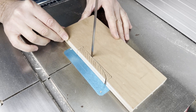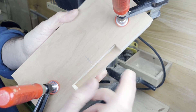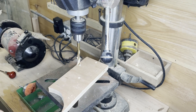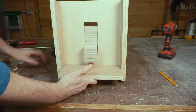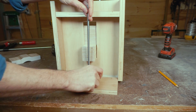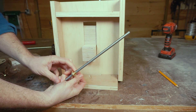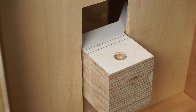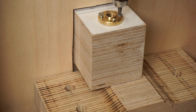This is one of two ledge pieces that are holding the lead screw in place, and this one needs a little notch cut out because there's a dust guard that passes through it. Then I'll clamp that to the other ledge piece so I can align the holes being drilled in them and drill them both in a single pass on the drill press. Here's the carriage — this is the bearing block that's going to be attached directly to the carriage. Those two ledges are going to have bearings on them, and this lead screw nut is going to be right on there. I'll mark that off, drill a clearance hole that the lead screw can pass through, then counterbore that to make space for the bearing nut. I'll put the bearing nut in, drill some pilot holes, and put a few screws in there just to hold it in place.